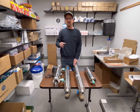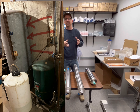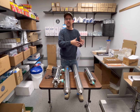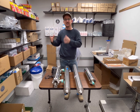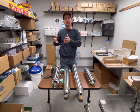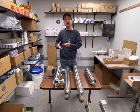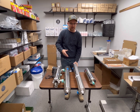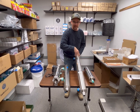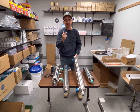With a chlorine injection system, there is always a large 85-gallon retention tank included with the injection pump. Once you pump chlorine into your water supply, it has to sit in that retention tank for 20 to 30 minutes to have adequate contact time to work with the bacteria and make sure it's killed off. UV, on the other hand, is instantaneous — as soon as the water passes through and the light hits the water supply and hits the bacteria, that bacteria is sterilized instantly.